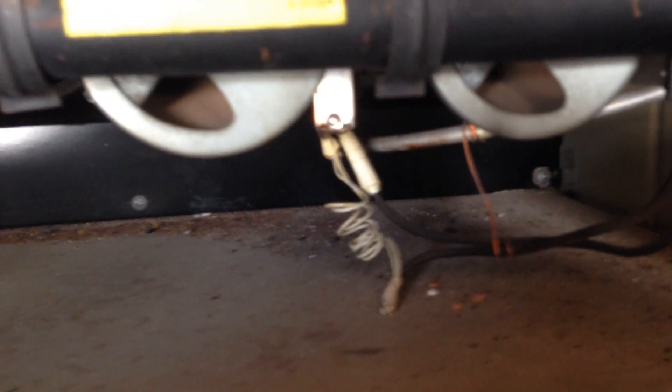So in this situation we need to take out this old gas valve, the pilot tubing, and disconnect the wiring. We've also got to take out this pilot hood with that two-wire switch.